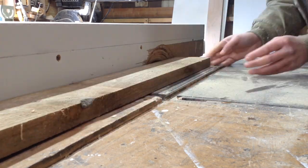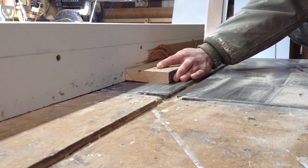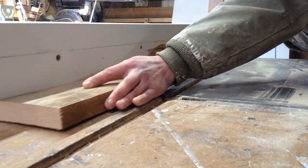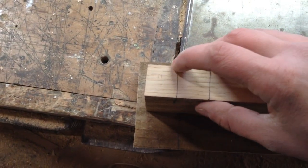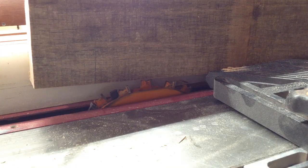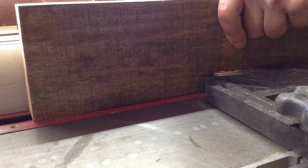The breadboard is about a four-inch piece. I roughed up this material during the rest of the build, so now I'm making a nice clean edge on my jointing jig — if that edge isn't perfectly square and clean it won't match the surface well. To cut the haunch part of the mortise, since the haunch runs the entire length of the piece, I set up carefully and lower the piece onto the blade. I can't go past the second line on my board because that would show on the edge of the tabletop. Once again, three-eighths of an inch — a three-eighths inch dado stack.